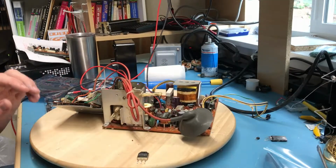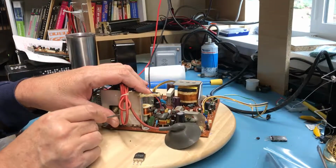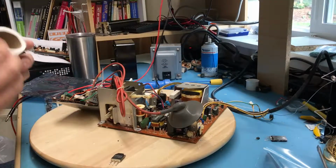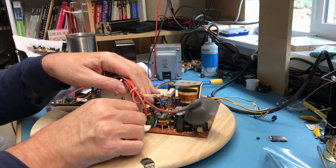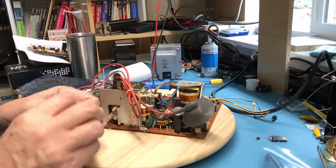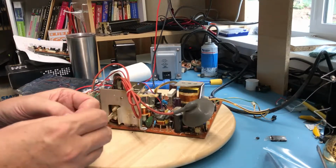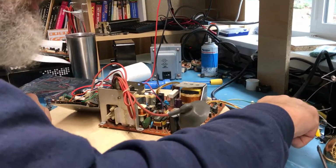It's a pity I didn't check that before. I got so focused on the power supply being the issue. I'm going to see if I can, that mica washer is going to peel. I'm just going to leave that mica washer on there. It wants to peel apart, and I will reuse it. But I can wipe off some of the really dead heatsink compound. Now the question is, do I have anything to replace this with? Yeah. It's a D1398. Don't know, based on that part number, what it is or isn't.